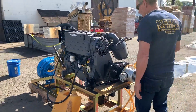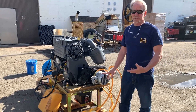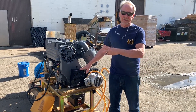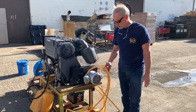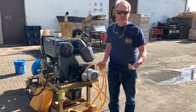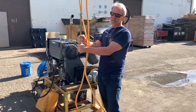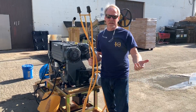This is an option we put on the different gravel pump systems — we have an air compressor, because we actually have guys who are going to be diving underwater and breathing. Why have another engine when you can drive it off this main unit? We've come off the motor and we manufacture our own extension shafts, adapt a pulley to it, and that drives the air compressor. You'll notice this spaghetti of air hoses coming off the intake. Obviously, you don't want to be breathing carbon monoxide or diesel fumes, so we have it equipped with a little air tower here. This will typically be clamped to a handrail on the boat or similar, set 10 to 15 feet away from the engine, ensuring you're going to be sucking in clean, fresh air.